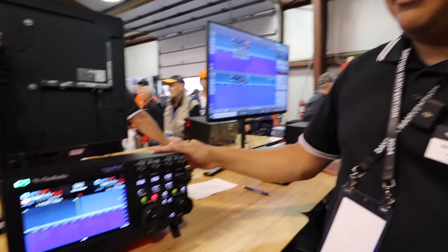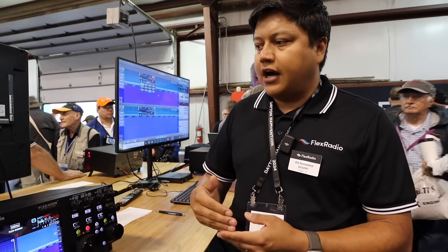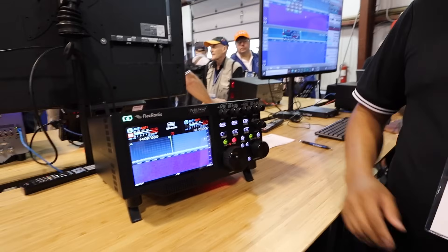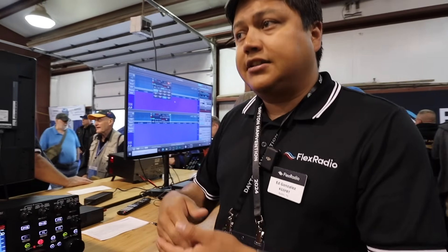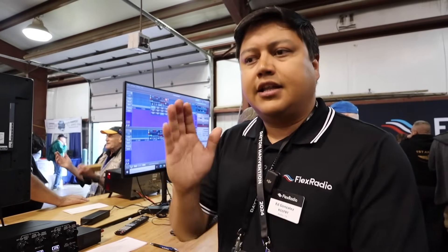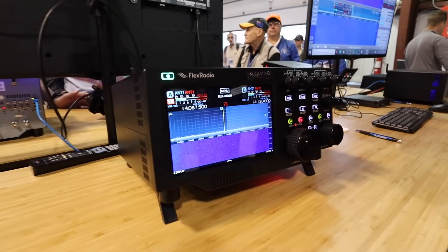Can you explain how you would connect a third-party amplifier? All of these new radios have adaptive pre-distortion hardware built in. We can get a very good sample input on any of the antennas for your transmitter. Things do get more complicated with third-party amplifiers. You can do it standalone, use our PGXL — which has a built-in sampler port — or use an external sampler to pass sample data from an external amplifier and correct both the internal PA and the amplifier with adaptive pre-distortion. We actually discussed this at our banquet last night and have a running slideshow showing different configurations with different amplifiers.